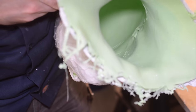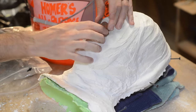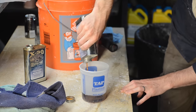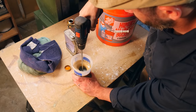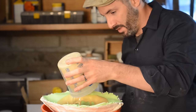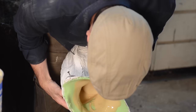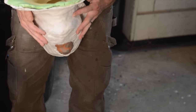You can see there's a huge amount of detail on the inside of this mold. He shoved some small pieces of clay up into the nostrils and then reinforced the outside to keep it in place, making sure none of the casting material could leak out. For this quick cast, he used X30 — it's an expanding foam. In the long run it's not the thing you'd want for a final casting, but it only takes about an hour to set up and all you have to do is mix the parts one-to-one. First he poured it around the top edge so it could run down all the faces and get into the nooks and crannies. There are a lot of areas to fill — the nose, ears, and so on — so he spun the mold around to get it to drop down into all those areas. This stuff is already kind of thick and starts setting up quickly, so it doesn't necessarily drop into all the detail, but this is a quick cast.